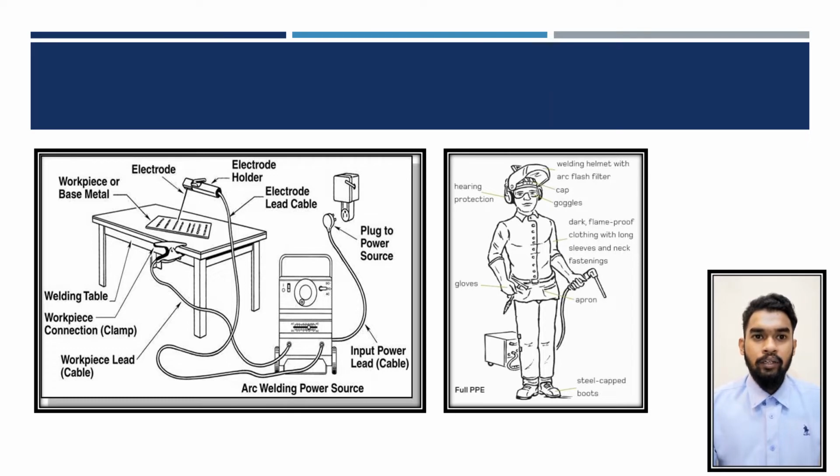Heavy leather gloves, a long sleeve jacket, and a welding helmet are all required. If the filter in the helmet faceplate does not shield your eyes from the ultraviolet radiation generated during the welding process, it might cause retinal burns and irreversible eye damage. Furthermore, the welding process might emit fumes that are hazardous to your health. Thus, enough ventilation is essential.